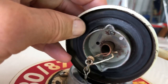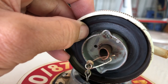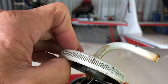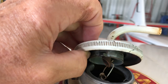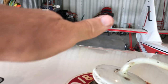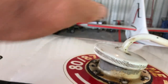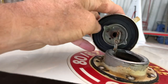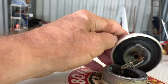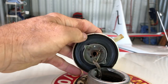So shazam, look at this. See that little hole right there? That is a vent hole. The problem I was actually having was the fuel was expanding, and also under flight, the low pressure area created over the wing would actually suck the fuel out through this vent hole, and through that vent hole it would come out over the seal.